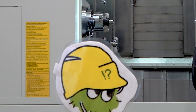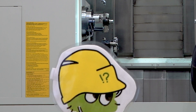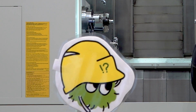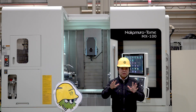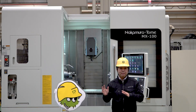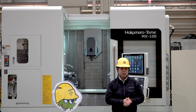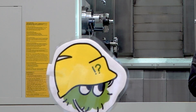After semi-finish, I measured the dimension of the work piece and adjusted the offset based on those measurements before moving on to the finish process. By using a larger offset value with a new insert or corner and making finishing based on the measurement results, you can avoid defective parts. Tomemaru, you got it! But looks like I messed up the calculations.